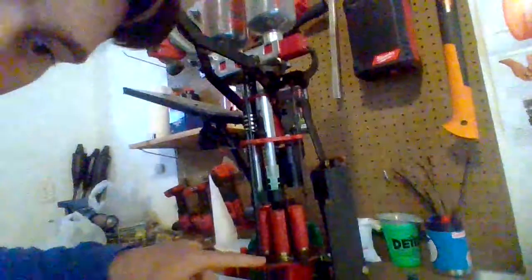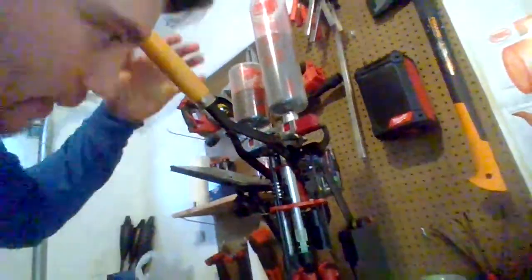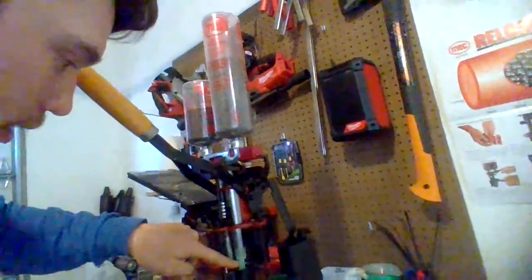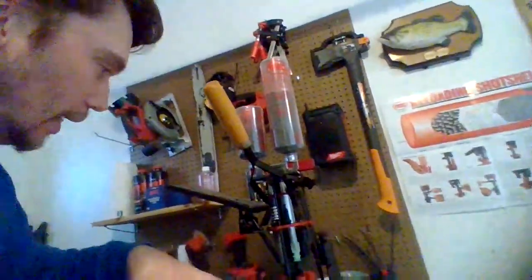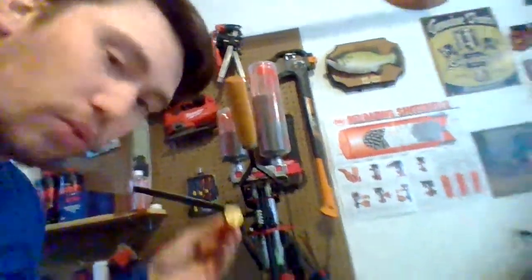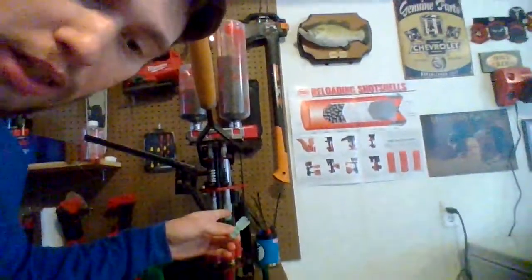As I manipulate the press, this shell is at the stage where it's about to get shot put in it. Here's the wad — that's the one-ounce wad. When the press gets pushed down, this arm will push the charge bar. That charge bar will first put shot through this tube into the wad. Then, actuated by a spring, it'll push the charge bar back, and it will put 18.3 to 18.5 grains of powder into this shell. The whole turret will move, the shell will go into the finished shells, and then I'll put another shell with the old spent primer on there, making sure to put another wad in place.